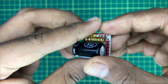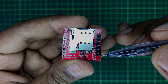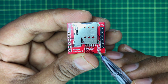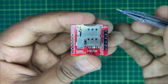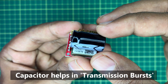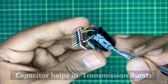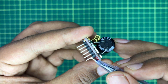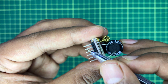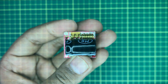Now let's take a look at the GSM module. In this SIM800L module, there are 6 pins on this side and the pin description is printed on the module. We use a 2200UF capacitor to keep a stable power supply for the GSM module while it is in transmission bursts. The negative pin of this capacitor is connected with the ground pin of the GSM module. If we are not using it, that can cause an unstable network connection.